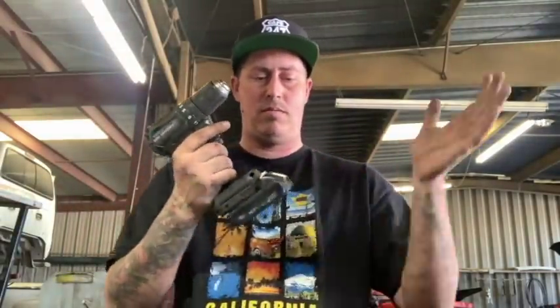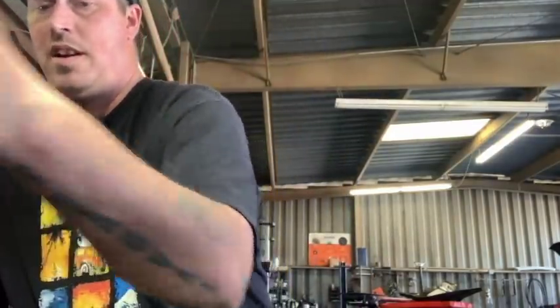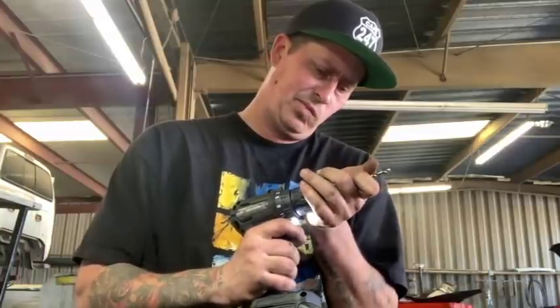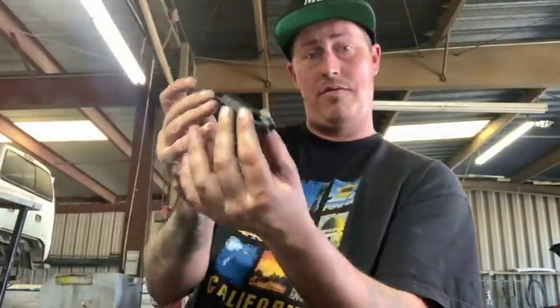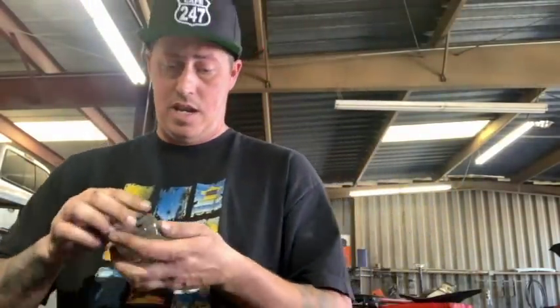Now I'm going to show you how to use a helicoil and what all tools are required before you go and helicoil. Let's dive into the video and see how it's done and what tools you're going to need. Today we are learning about helicoils. We're going to need a drill, and because we're going for the six by one, we need a quarter-inch drill bit. We'll need a helicoil kit - it comes with this little fancy apparatus, but we'll end up taking the coil itself and putting it on here.